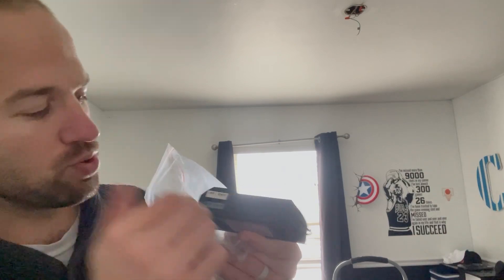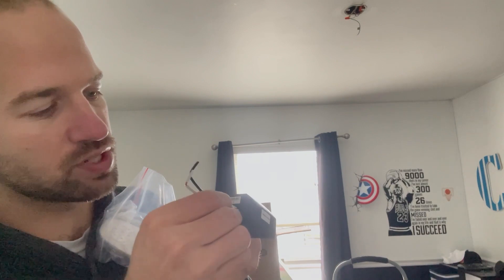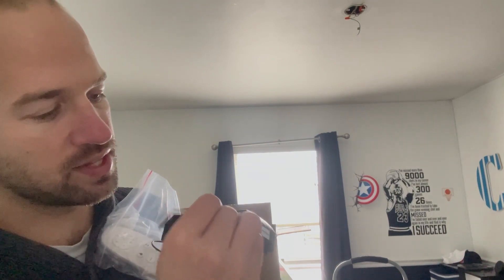This cord here ultimately connects on this side to the power outlet — it's just one of those clip connections. Go ahead and get this in here — there it is, it clicked. Then you'll peel off both the white and the black wire covers so that you can wrap those around the hot and cold black and white wires coming from your ceiling. You'll notice those coils — you'll wrap the wire nut around there.